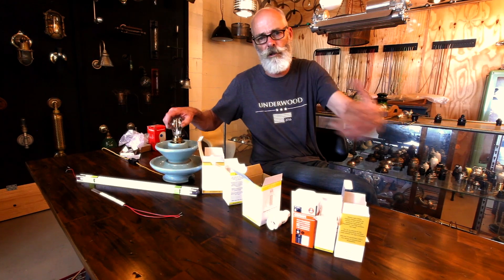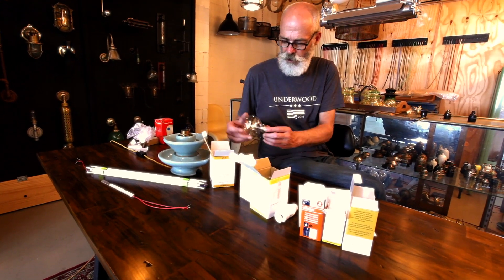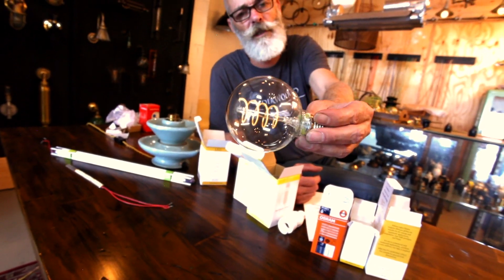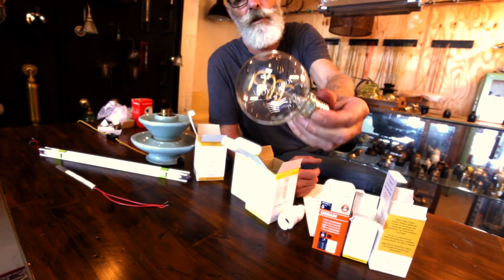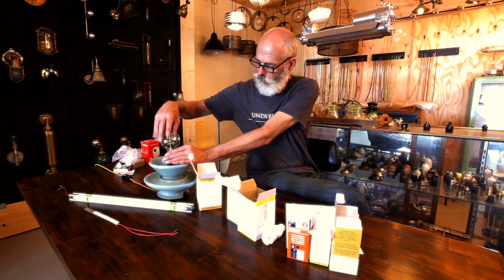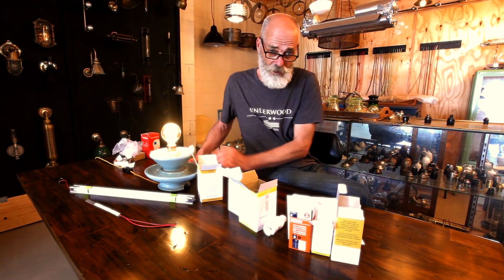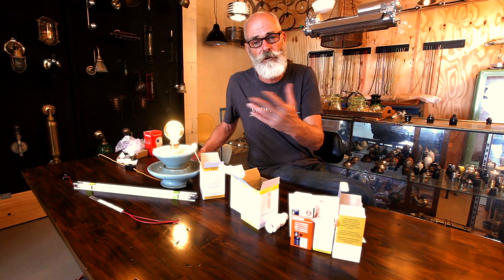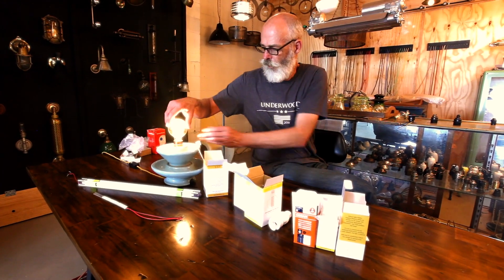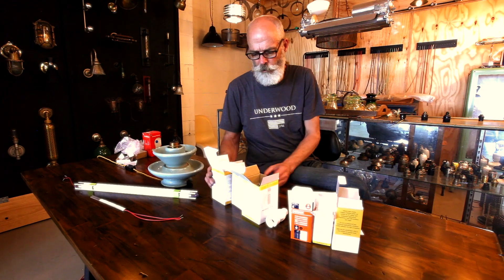In the last two years what we've ended up with is a globe that we can fashion into any shape we like at any length, because instead of short strips of LED it's a single long continuous strip. That means you get a nice decorative shape for the filament but also with the efficiency of an LED. This one is only three watts and still reasonably capable in a decorative sense — over a bench or over a dining table, three of these is enough, perfect light.